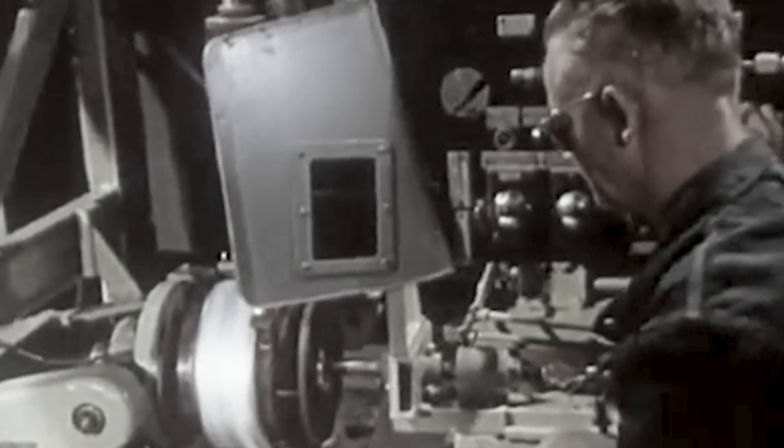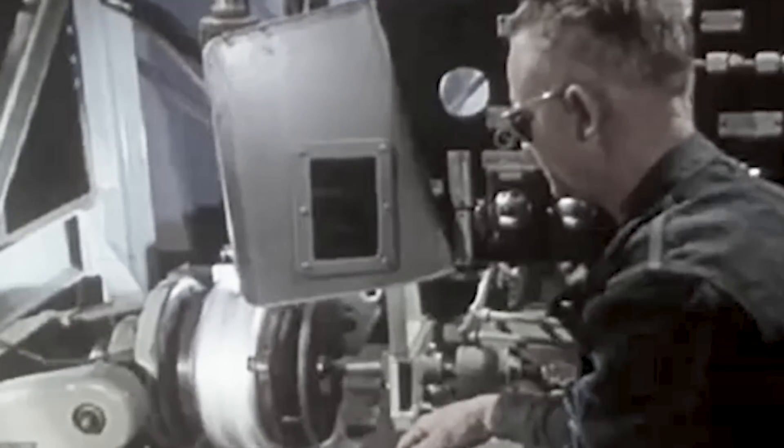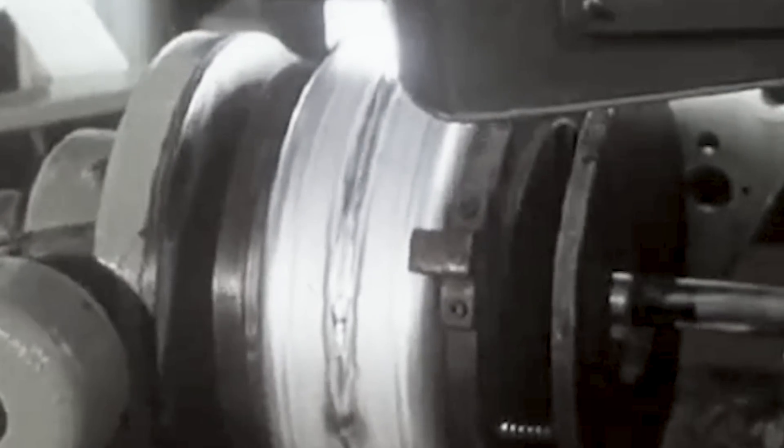It was revolutionary for the aluminum and magnesium welding process, but to put it lightly it was insanely primitive, because all we were given to use was what came out of the wall — and for most of the world that was a 60 hertz sine wave at 50-50 balance. Pretty difficult to work with.